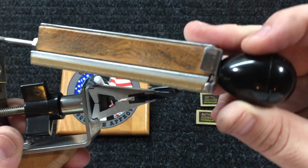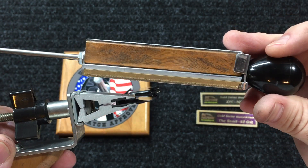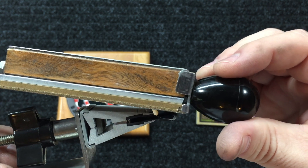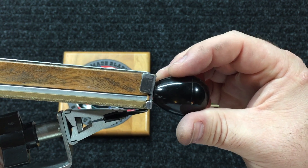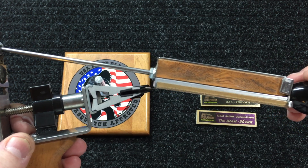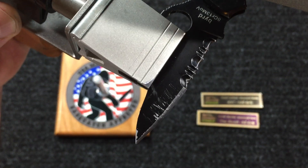The other thing that causes the scratch pattern on your blade is technique. Once you get good at it and have muscle memory, you're not worried about going too far and dropping off the top of the stone. But a lot of newer people getting a new kit for the first time — if you go too far up and drop off the back edge of that stone so it goes up over the blade, you're going to get scratches. If you go too far and the diamond surface scratches up on the side of that blade, that's going to leave a mark. Be careful on the up stroke — don't go so far that you drop off and scratch the blade.